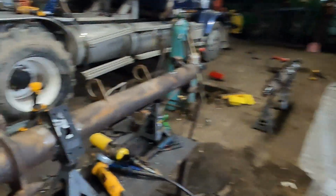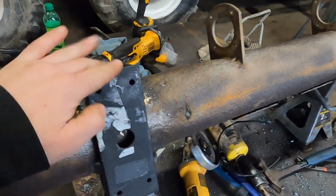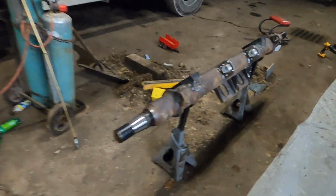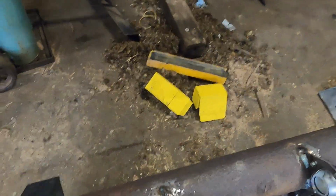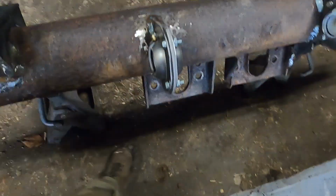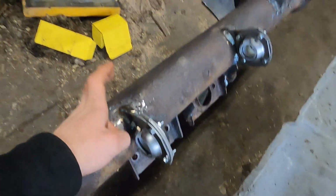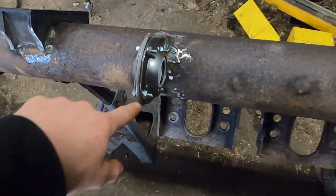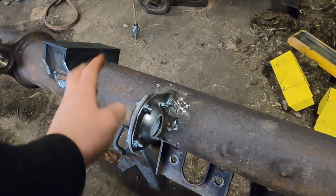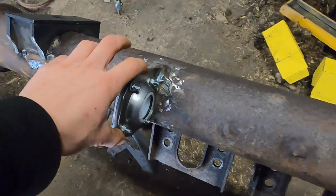And then Christoph's been working on these axles. He's been welding on these new spring holder parts. He's got this one all done. This one's ready for priming. On this axle, we had to put these new holders on that hold the end of the S-cams because the other ones were a different design. It was a three-hole design and we couldn't get those anymore. These bushings like that, so we had to put new holders on.